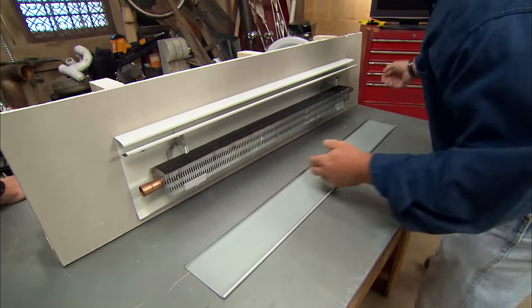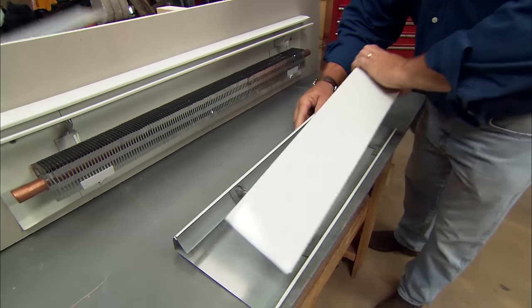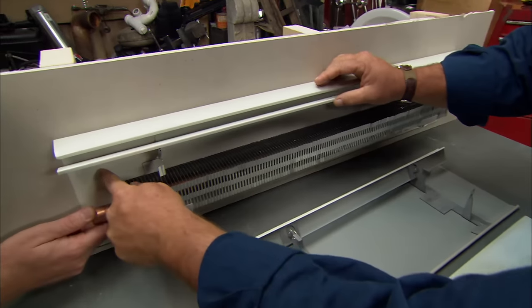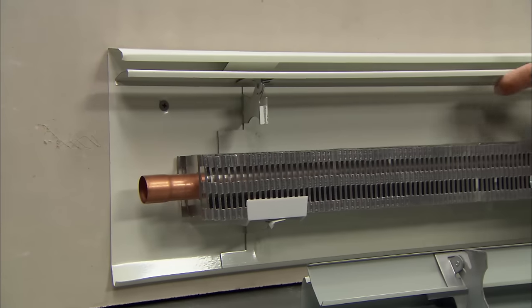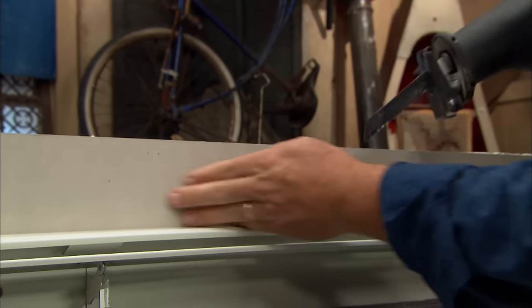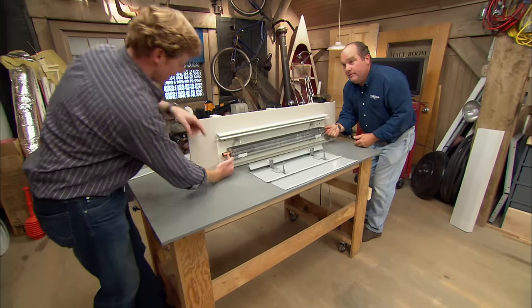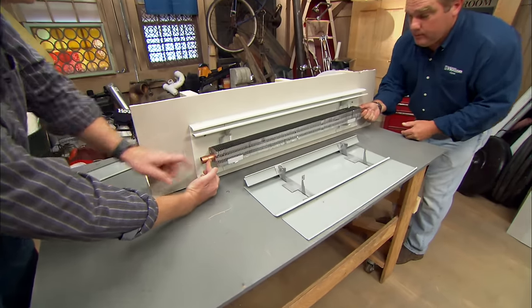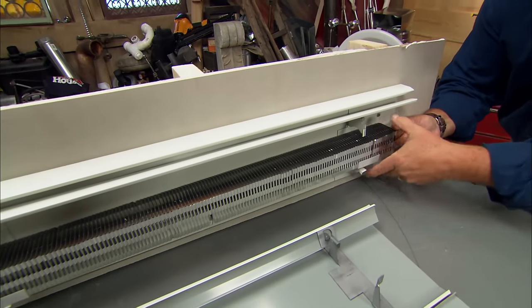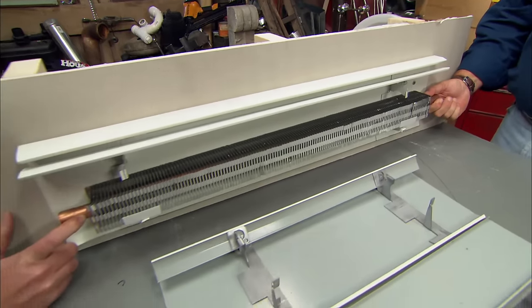The element is going to stay right here. They actually sell what's called a dummy — it has no heating elements inside of it. If you're going to replace this piece, you'd have to get this back plate off of the wall, which means removing all the screws. If there are nails, you may have to take a reciprocating saw and come in behind this back plate, being careful not to scratch the wall. Remember, this element is still connected — it's attached to the rest of the plumbing, so it's not really going anywhere. You have to figure out how to get this back plate out and also this carrier right here — you may have to wiggle it out and bring it out the side. It can be a little fussy.